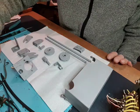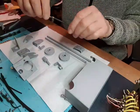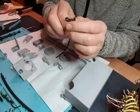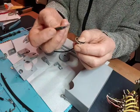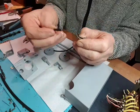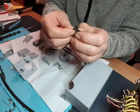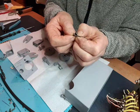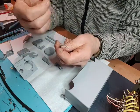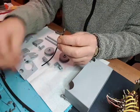I was also doing the top cap connections. There was a resistor that goes in there — it's one of the thicker resistors. I thought I'd use a more modern resistor, but the one I had was very small, so I tried putting heat shrink on it to build up the thickness, but it would need an awful lot. So I've decided to use two-watt resistors — a bit overkill, but I think the size will be correct, and then I can connect them up there.